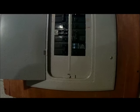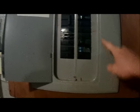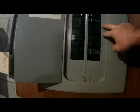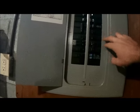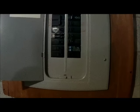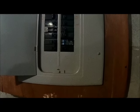Obviously the first thing that we need to do when we go and release the well pump coming into the house is turn the power off. Here it's running on 220, so we have the breakers off to the well. Whenever you turn the water off, you always turn the water off to the hot water heater. It's electric as well here. So safety first: turn the power off to the well before you even open up the well cap and take a look at that. So that's step number one.